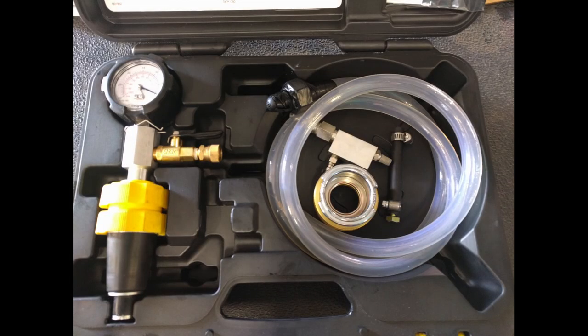This is a really handy kit — it's a must-have for heavy-duty equipment or trucks, anything like that. Especially when you've got a lot of different oil coolers, hydraulic oil coolers, bunk heaters, cab heaters — all places where you could get a potential airlock in the system. This helps avoid that problem. It also allows you to check for leaks before you even fill it up. You can't trust it 100% all the time because sometimes after you've pulled the vacuum down, you fill the unit up and run it up to temp, you can still have a leak — but it'll avoid probably 90% of the problems out there.